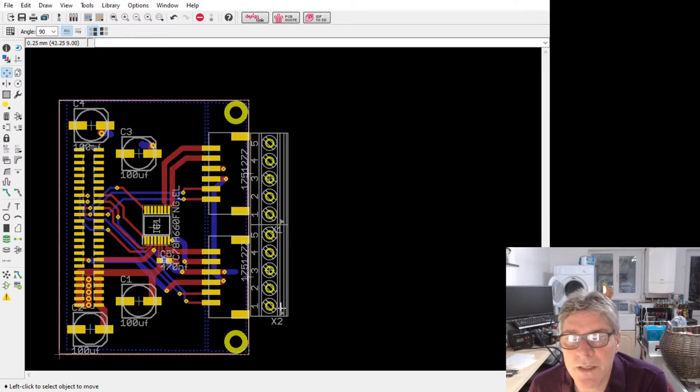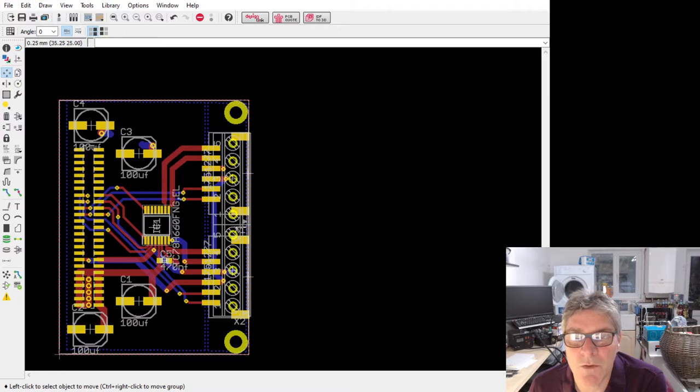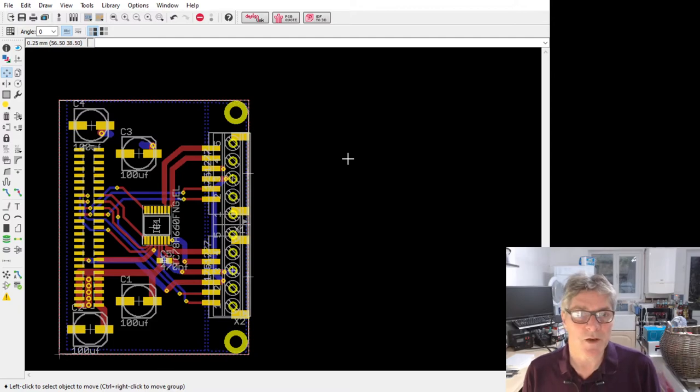So yeah, we could use 10 screw connectors. They'd obviously be the other way around because they'd be on the top rather than bottom. But those would fit in, to where the motors are now. And the two center ones would be the power. The Hall effect, ground and plus minus 3 volt. That would be common, so you'd have two wires going to each one of those.